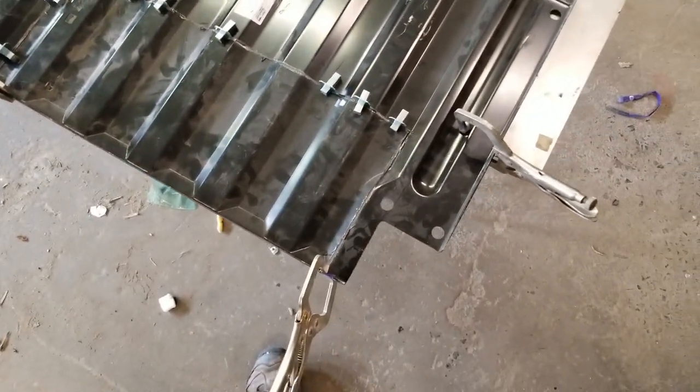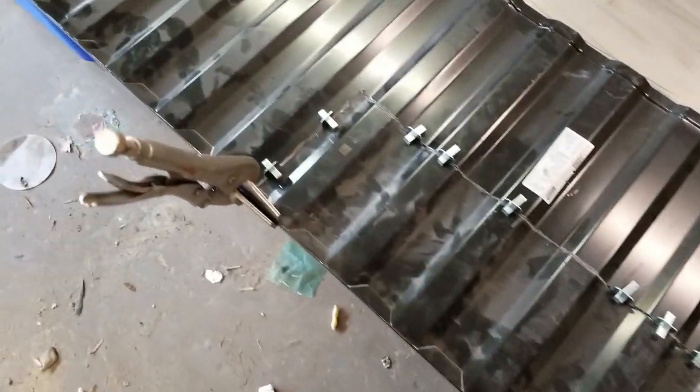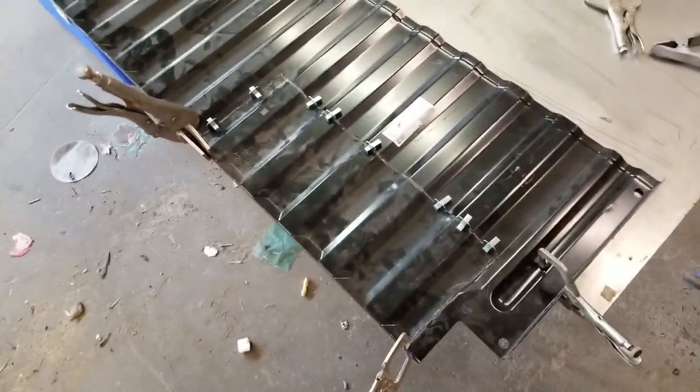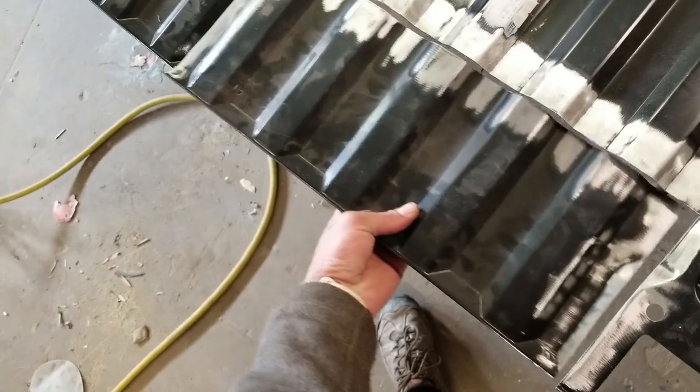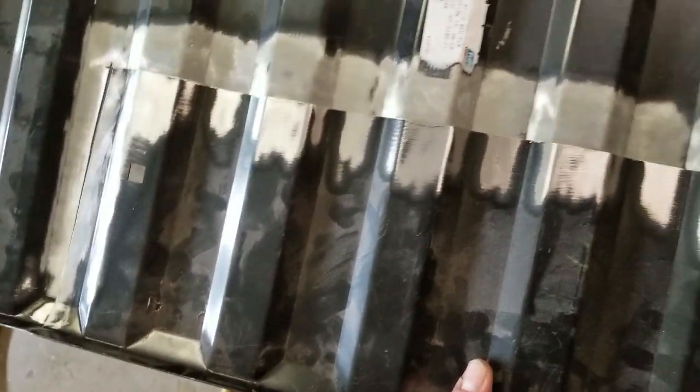After an enlightening session with the Buddha gods here, I came up with a great idea to weld it from behind so I don't have to grind all those welds away to make a good surface. Got these areas prepped up the best I can, going to put that back together with the clamps, and I think I'm going to start my welds from up here and work my way out, so I'm going to align these clamps accordingly.